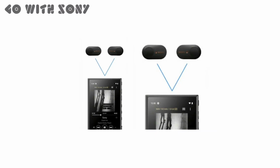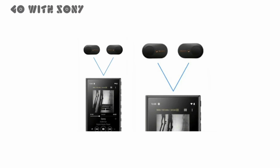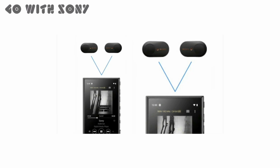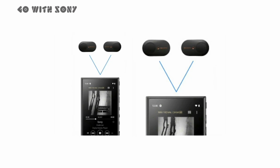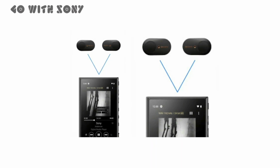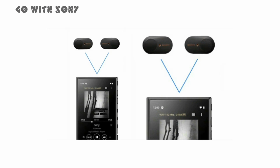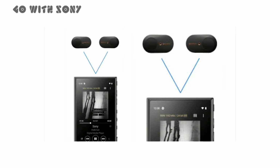The new codec is said to also offer lower latency and multi-stream, which will allow the transmission of multiple, independent, synchronized audio streams between an audio source device, such as a smartphone, and one or more audio sink devices. So basically independent audio streams to two wireless earbuds. I think this is similar to Airoha's MCSync, but I have no idea how MCSync works and what tech it uses. The MediaTek MT2811 also uses MCSync. Multi-stream, together with broadcast audio and audio sharing, uses LE isochronous channels, which is part of Bluetooth 5.2.